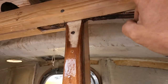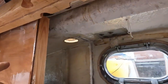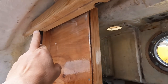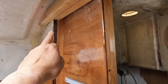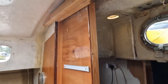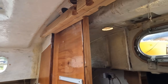I've got a piece of timber to put in to join this bulkhead to this beam, and once that fiberglassing work has all dried I'm going to put some bolts through. So I'm looking at a bolt through here, a bolt through here in the post, one through there, one through that post, one at the other end joining the two support beams, and one through the support beam and the bulkhead and the post at the far end. I don't want to do that until I've done the fiberglassing so that the bolts are on top and could always be undone.